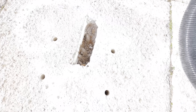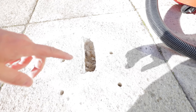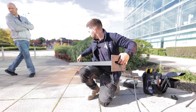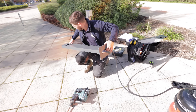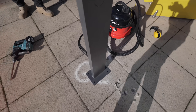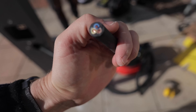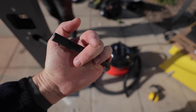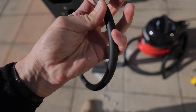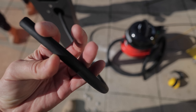We are chased out here now, so that's all good. We're ready to put our anchors in and run our cable in. Luke is running the cable inside the pedestal now, pulling it up ready to go inside the charger. The pedestal's in place with the cable popping out here. This is what we call HO7 rubber flex cable — the kind of cable used often in temporary electrical installations. It's really, really tough, so you can step on it and it won't break, which is ideal for this kind of situation.